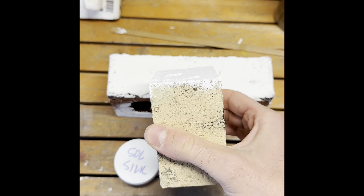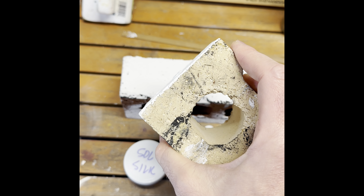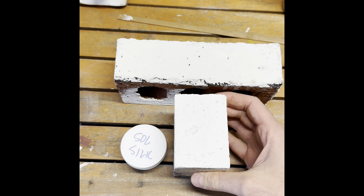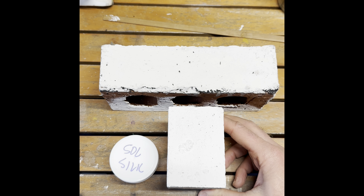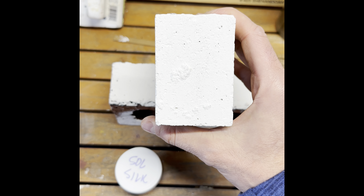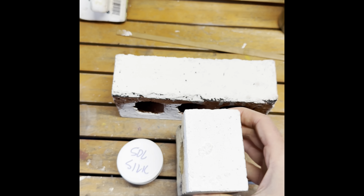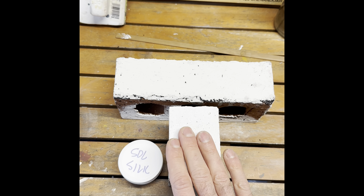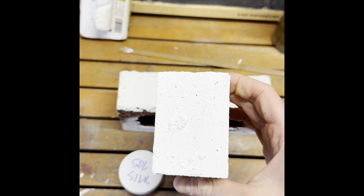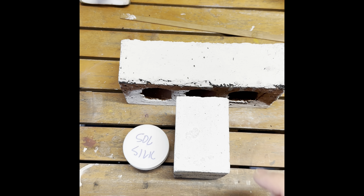We've applied over it so it's basically permanent with the existing paint. It allows breathability, and if the original paint is more than two or three years old, the resin is essentially baked off — all that remains is the leftover pigment. This is the best solution to avoid media blasting to remove existing paint. You're not putting traditional paint on top of paint — you're applying a product that is breathable, UV protected, and gives a natural look. This can also be used on interior drywall using an interior primer, making it suitable for eco-friendly interior spaces.